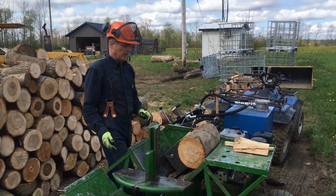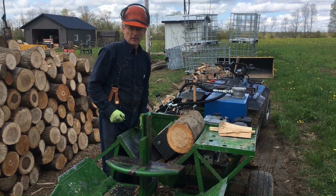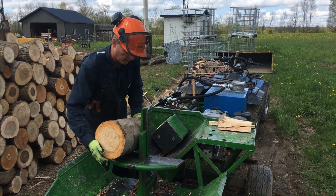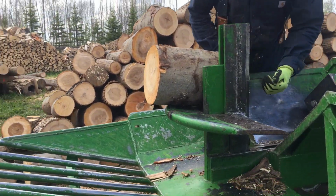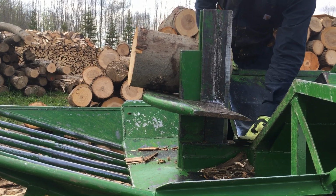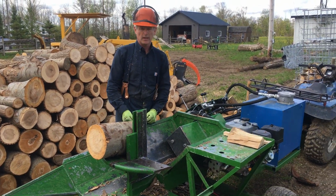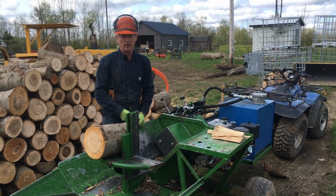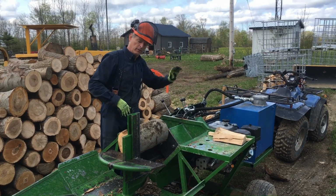No worry about dropping it onto the cylinder and damaging your cylinder or the rod there. The wedge is designed with a really big shelf at the back. So with the 4-way wedge, if you're splitting a large log, set the wedge so that the bottom two splits are the size that you want and the rest of the log is sitting on the top. Then you split it, and the two top halves will sit right there on top of the wedge. They don't fall off. Then you just grab them, flip them back over, and they're in front, and you can push them through for another split.